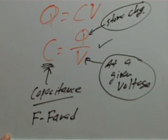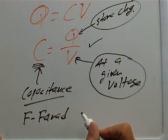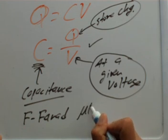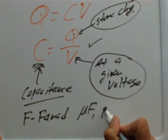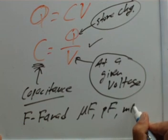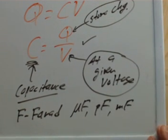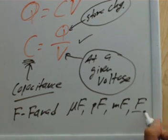And if you go looking in the back of Radio Shack or in some simple electronics books, at common circuits that people might build, the farad is actually a very large unit of capacitance. Commonly we'll have things like microfarads, meaning 10 to the minus 6 farads, or a millionth of a farad, or a picofarad, 10 to the minus 12 farads. Sometimes you'll see something like a millifarad, but what's neat about today's rapid technological advances is that they have very large capacitors now that might even reach into just the F, just the farad.